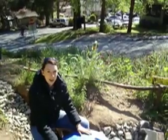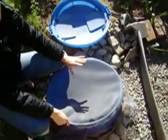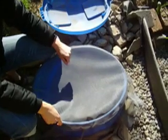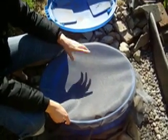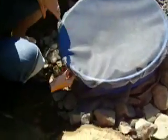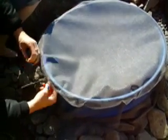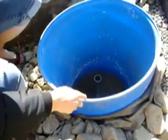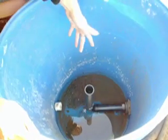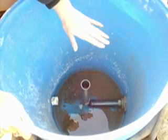This is the water quality testing tank, also known as tank number three. So now the water has been filtered — it has had all the fats, oils, and greases removed, as well as total suspended solids, and the BOD has been significantly reduced. This mesh screen right here is to keep mosquitoes out and can be opened. In here, this plumbing is to allow CCAT co-directors and any maintenance people the option of changing the height of the water in the marsh.